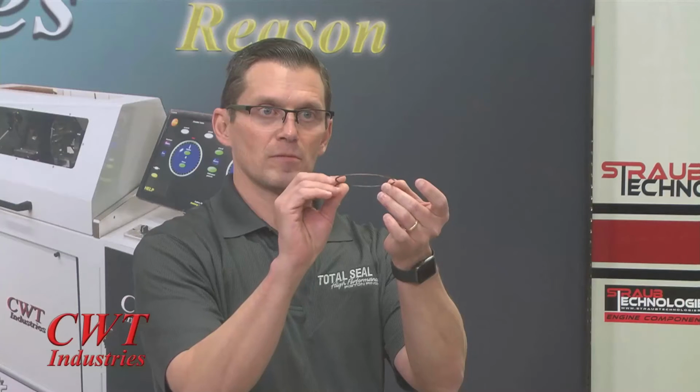Well, simply enough, ring rotation is influenced by crosshatch angle. You actually want the ring to rotate. Now, this guy's question was about the fact that the piston isn't moving the same velocity all the time, and that's true. But you do want the ring to rotate. It needs to rotate. Otherwise, if you stick a ring, even just a little bit of micro welding, you'll see blow-by shoot up because now the ring is hydroplaning, and you don't want that.